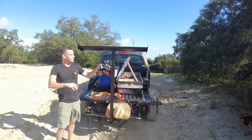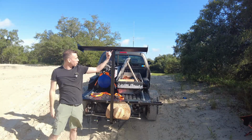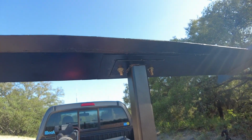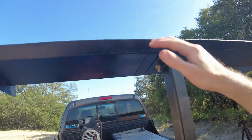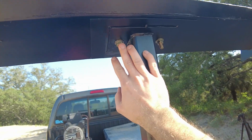And I actually really wanted to have all my weight hanging off the edge of the wing, but I'm kind of afraid I'm going to break it. That was actually the point of doing the little spring system under here, like a leaf spring. Obviously it's bolted on, that's not the best for the aerodynamics. The underside of a wing is what actually generates the majority of the downforce. So you get high pressure on top and low pressure on the bottom. So these are in the turbulent flow, but that's just for serviceability in the future.